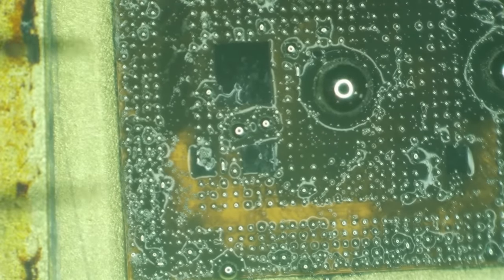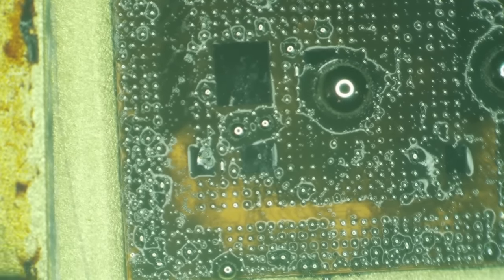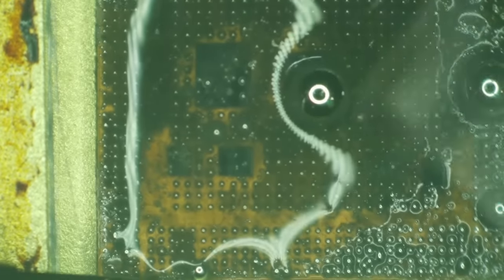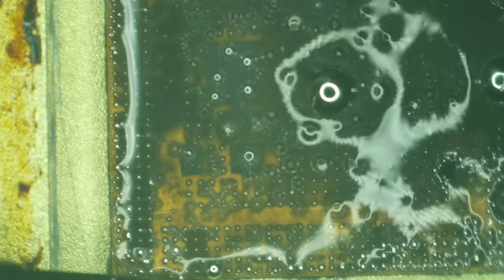I'm going to go ahead and take my 2032 micro pencil and start floating around on this. So we'll add some flux. It also makes a really good tool for cleaning this glue off. So does flux. Flux takes this glue off really well. So I'm going to use my micro pencil to be sure I don't have any hard balls left.